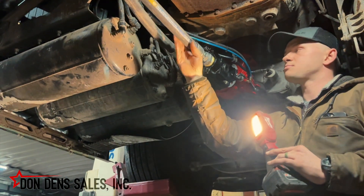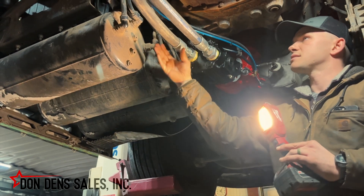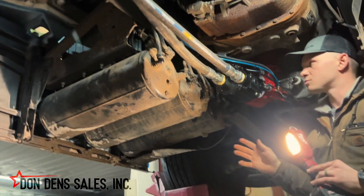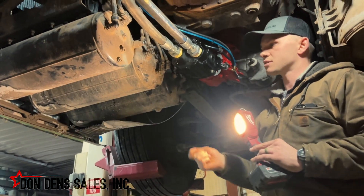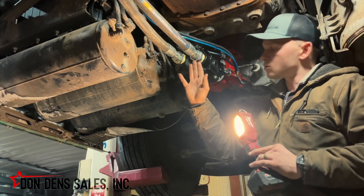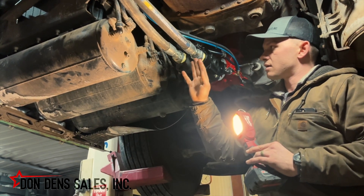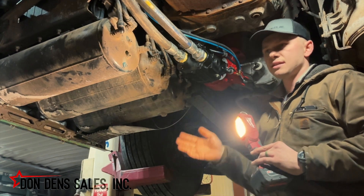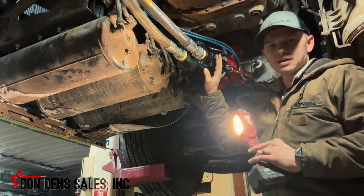This side on this pump, because of the rotation of the transmission, is our pressure line. This one's our suction. There are various ways to find that out, but the quick method: have somebody in the cab pop the PTO on just for a second. If you hold a piece of paper up to either port, it should either blow a little bit of air out or try to suck the paper in — that'll tell you which one's suction and which is pressure. Do it very quickly and very short, as these are not made to run without oil in them.